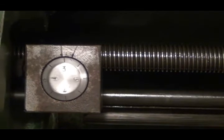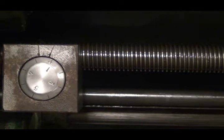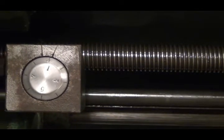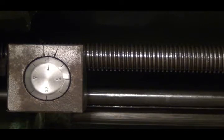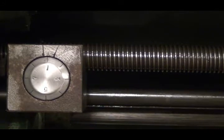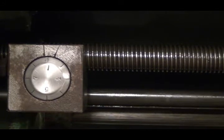Okay, here we are at the lathe. I'll see if I can show you this. I just don't get it. Right there is the 1 on that little line in the middle, and I got it locked in. But now watch — I can move the carriage that much with the hand wheel here. So there is a little slop. I think I need to adjust the half nuts.